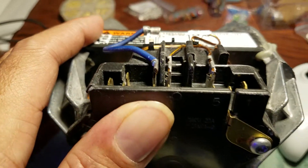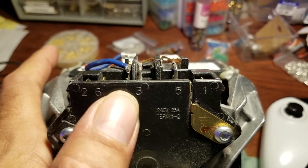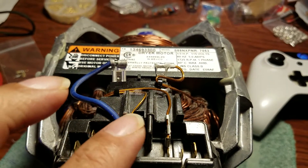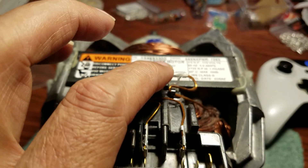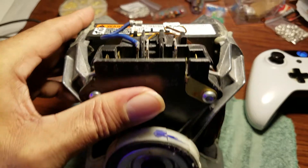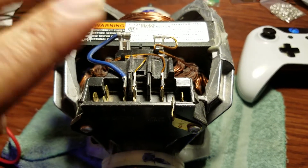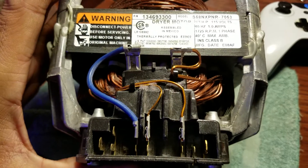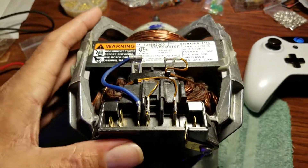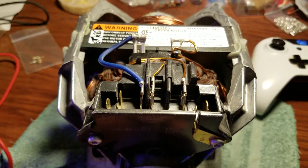Five to three shows low resistance, five to four shows higher resistance, and three to four shows higher resistance. I can touch any of these and connect them to the back one and get resistance. My dilemma is that I was told there was no capacitor — my friend didn't see any capacitor anywhere near the motor when he took it out.